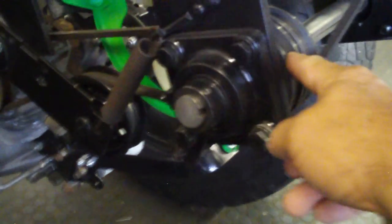The drive belt was quite a challenge. If I had to do it over, I'd use a transaxle with the drive pulley on top instead of the side. I had to mount a shaft up top and use matching-size pulleys — same size as what's on the transaxle — so we wouldn't speed it up or lose anything. This thing runs about 15 miles an hour with these big tires, and I didn't want to overwork the transaxle. I wouldn't want to go faster anyway — as high as this thing sits, backing it off the trailer is already pretty spooky.